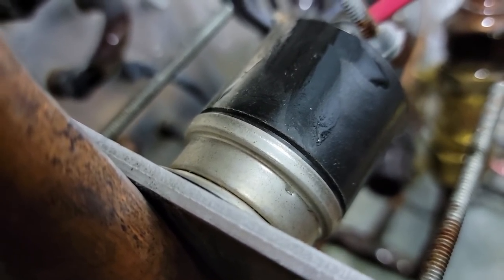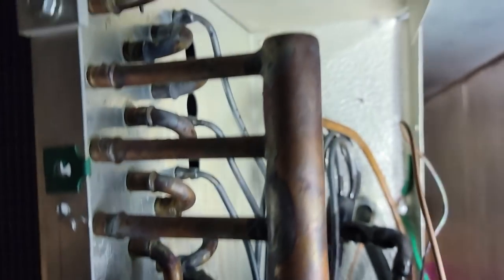I don't see anything leaking down there on any of that — can you see all the oil down there? All right, we was able to get that up and going. Everything on the rack was coming down to temperature. This call is about an hour and a quarter away from home. The store didn't have any refrigerant, so we had to pick some up from another store. We dumped 100 pounds in there and we weren't even getting the floats up. That was R507. I scanned around some of the other cases — I was there earlier on Monday and fixed a leak on one of the other racks where a three-eighths line had rubbed against the evaporator fan bracket inside the unit and made a hole right through it. That was a hellacious leak.